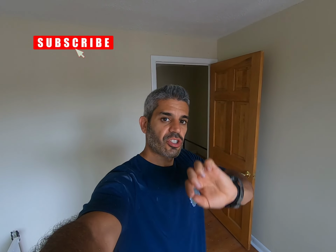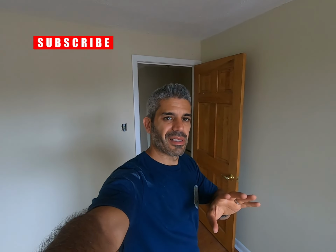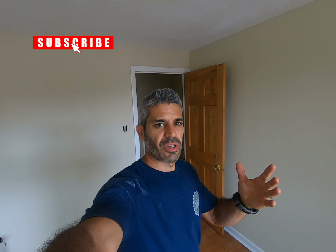Also, what I'm not showing you here is I'm gonna go back in with some batt insulation around the gap between the framing of the wall and the window. You gotta make sure you do that. And then I'm gonna use trim on the inside and some nice caulk. It's gonna look like a $1 million window by the time I'm done with it. All that stuff I cover in the other video, but it's pretty much straightforward.